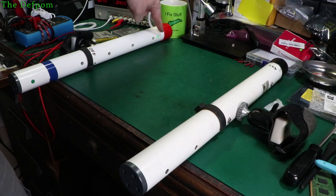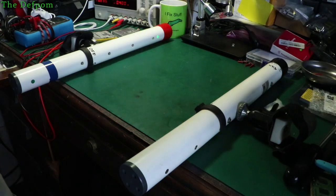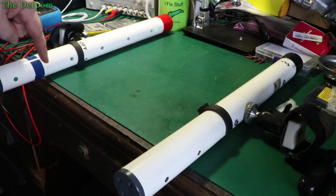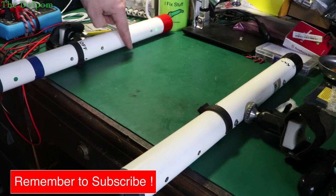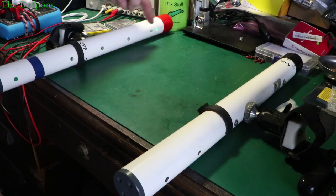It's currently powered up. You can't really see these - you need it to be green. I'm going to turn these lights off so you can see it. You can see a green LED right there, it may have gone a bit grainy. So if I block each light curtain you'll see it should change red. See, that's gone red, that's gone red, that's gone red, and that's gone red. So this side is all working.